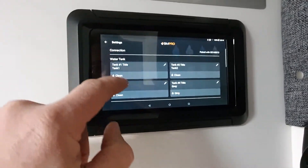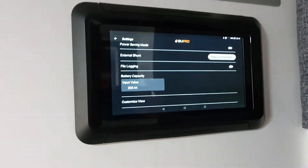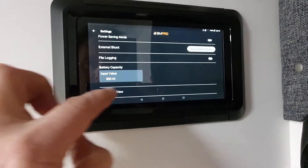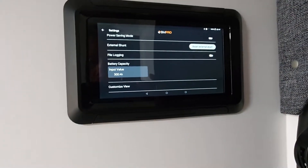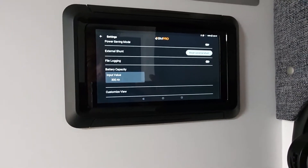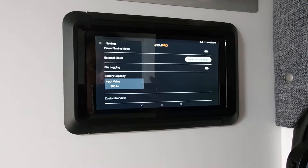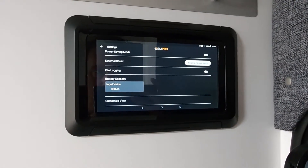So go in here. Now, if you were running the HA series, it would also come up here with a line that asks you: do you want a lithium charging profile, or are you happy with a standard lead acid charging profile? But this one — this caravan — is running the SR version, so it does not give us the option for lithium batteries.